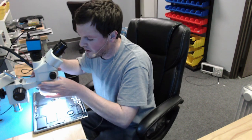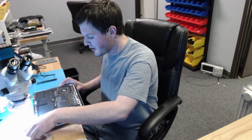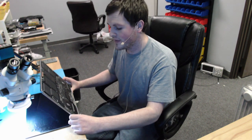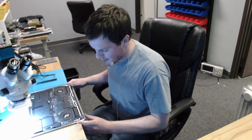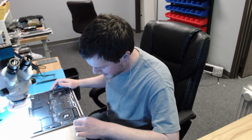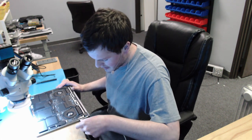We're going to quickly rule out if this MacBook is in DFU state. A lot of times these T2 machines are going to suffer from being in recovery mode from T2 corruption. Usually when you have T2 corruption you can get 5 volts or 20 volts, there's usually no amp draw, and you will characteristically have PP5VS5 missing — that is very common. One quick check is to plug it in and check PP5VS5. If it's missing, this is most likely going to need to be recovered in DFU mode.